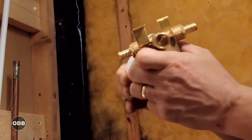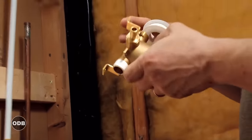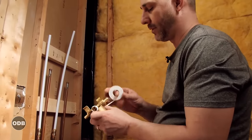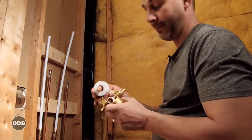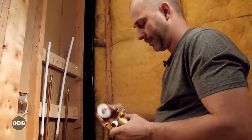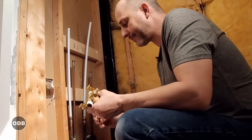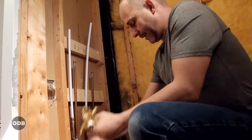When it comes to plumbing there's outside diameter and inside diameter. What we're dealing with is all half-inch outside diameter. When you go shopping there'll be different sizes — half inch and three-quarter. Most water supply copper pipes in the house are half inch; if it's modern it'll still be half inch but in plastic piping. Three-quarter supply is a much larger volume — sometimes people use that on the hot water going to the tub if they want a large fill volume. Traditionally, half inch is all you need.